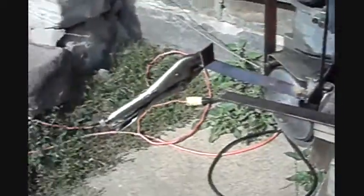It's not exactly eight inches — the measurement changed. I already cut one piece. I made it a little shorter just in case the piece of steel isn't exactly ten feet. If it was ten feet I'd get fifteen pieces, but I'm worried the last piece will be about an inch too short. So I'm compensating by making this piece seven and seven eighths. It's not going to matter because when I put the plates over the ends, it'll cover them up — and if I cut the ends crooked, they'll be covered by the end plates too. It cuts pretty straight though.